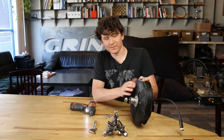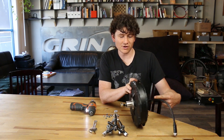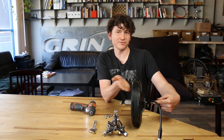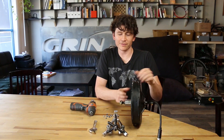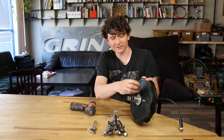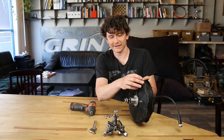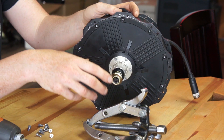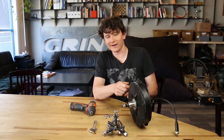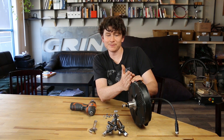With the side plate bolts fully removed, what we're looking to do with the gear puller is push on the motor axle from the opposite side of the side plate that's coming off, and that's going to move the entire contents and guts of the motor out. In doing so it's going to break the seal between the side plate and the rotor body. That seal is bonded with silicone, and if you don't have a gear puller you need quite a bit of force to pry it off. Some people will try to wedge in an exacto knife or a sharp blade to initially break that seal.